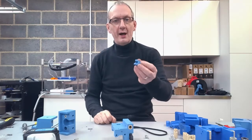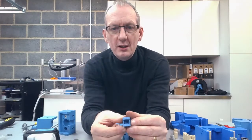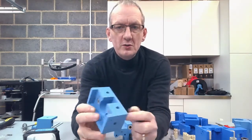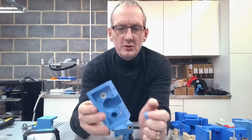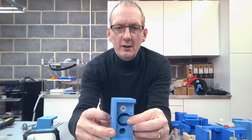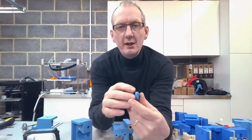What I decided is I wanted to look at how we could allow the belt to pass through the pulley wheel but also have some tension. You can see there's a little hole on the back of the tensioner housing, and through the center we can position a nut on the inside. When these sit into the supports using the hole there, an M3 bolt passes through, allowing us to effectively tension it by tightening or releasing the bolt.